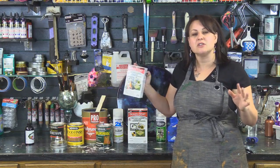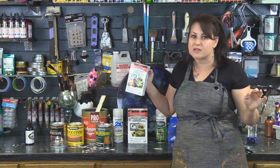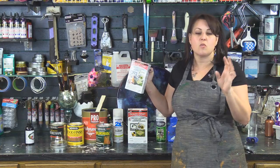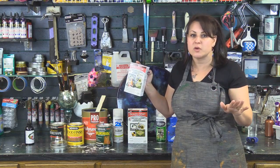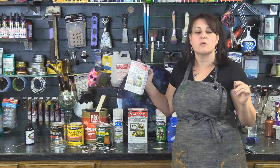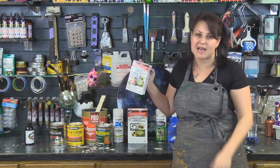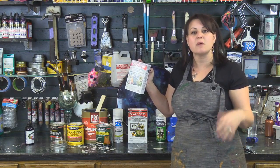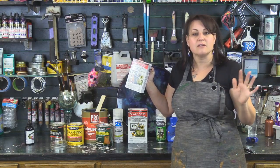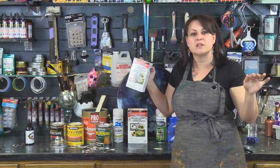Because one thing you can do with glaze coat, if you don't want the clear, super glass-like finish, but you want that big, thick endurance of having the waterproofing and the 120 degrees Fahrenheit protection, is that you can use your orbital sander on a real high grit and go over it and give it a satin finish. If you ever come to our shop and you see the galaxy table, that's what happened there. It wasn't by design. It was a large piece that I had done, and I got a couple little squigglies in it, and I said, you know what?